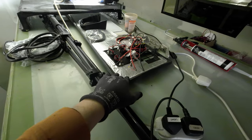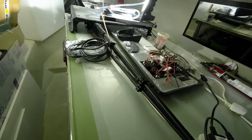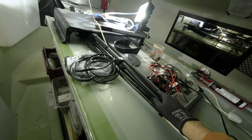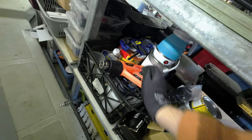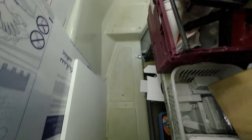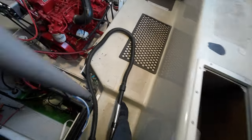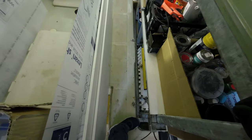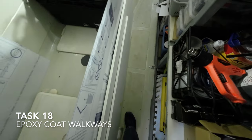Here is the battery box lid you've seen me make in a previous episode. The walkways are looking pretty tired — they're the original gel coats from the initial moulding, and endless work and bashing around has left them looking pretty manky. I've got some extremely high quality factory-floor waterproof epoxy resin floor paint, and that's going to coat the lower sections all the way down here. I'll do that quite late on, since there's no point coating them and then re-damaging them before I've finished most of the work.